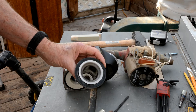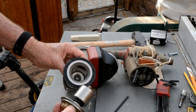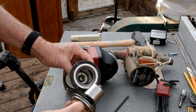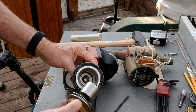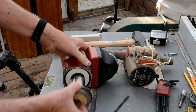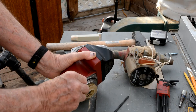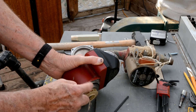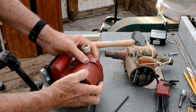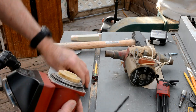You might try just pulling this apart, lubricating it, and putting it back together. If this is on a potable water system, only lubricate it with some type of food-safe lubricant. When you get the cartridge, you get this whole piece — just take it and put it back in the pump. If it doesn't go in all the way and isn't fully seated, don't worry, because when you put this together and tighten up the screws it will pull the cartridge all the way in and fully seat it.